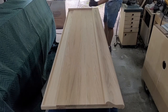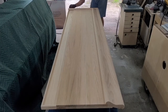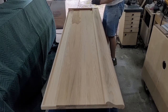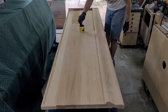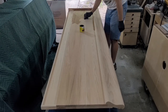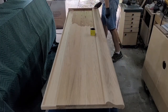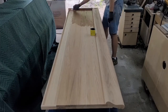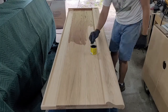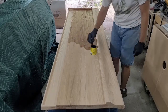I'd managed to avoid sweating on the top during the final sanding, but a storm was brewing and I didn't want my freshly stained top getting rain spots, so I moved it inside. I started by staining the bottom, then flipped it over and stained the top. I'm using a basic oil stain here to match my client's flooring. The stain is easy to apply — you just wipe it on, make sure you get in all the nooks, joints, and open grain, then wipe off any excess. You can work in fairly large areas at a time; the wood will only absorb so much and going over one area a second time won't add any additional color. Just make sure to wipe off all that excess.